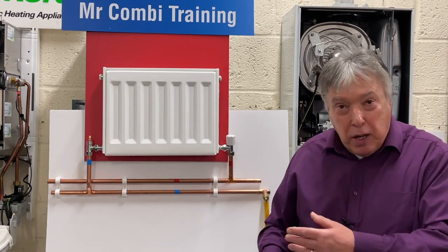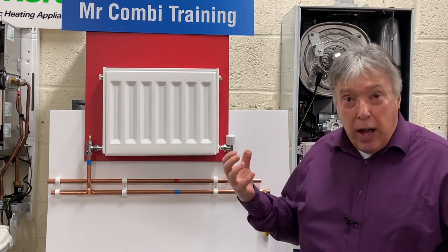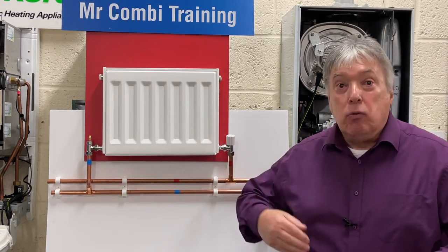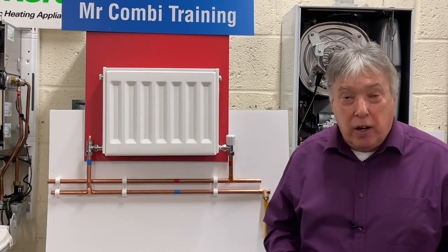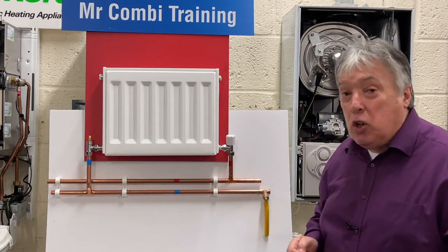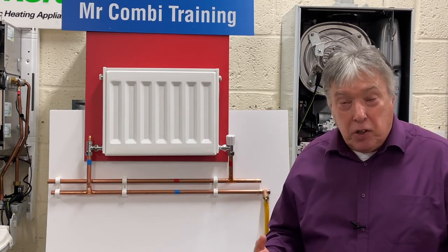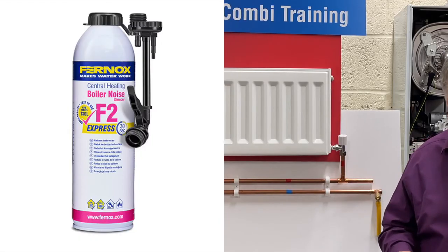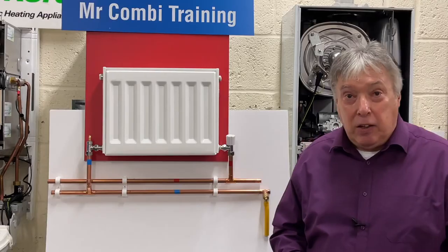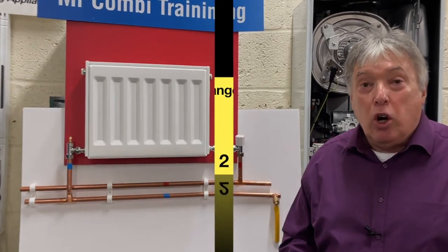And we do it the same way as before, but now, you know, it's going to be quicker and we've got our silencer in the system ready to be whooshed around the heating system first and then the hot water side second. So this is a really good fast way of introducing liquid into the system, or you use the pumping type ones which we saw earlier. Here's just a reminder again. So I hope you found filling and venting useful on an open system.